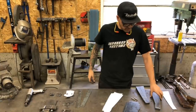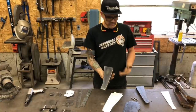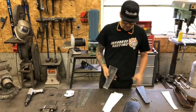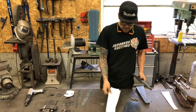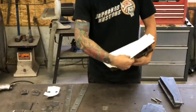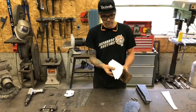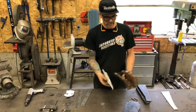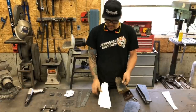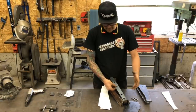I sort of cheated a little bit because I've got a machine that'll do it, but these are our hammer form dies. This is made from 3/4 inch plate. I've templated each side of this mount. You can see here, the tabs that need to be folded are all on here. I'm gonna make it out of three pieces. So one side here, and then a bottom piece. We'll butt weld and take this as one.